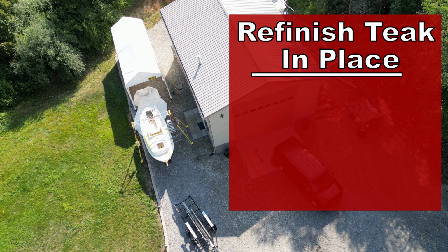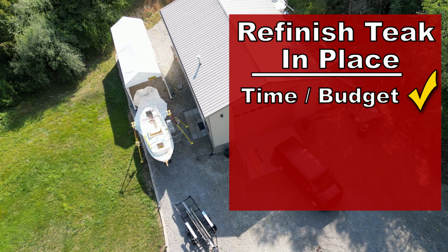There are times that it makes sense to go ahead and refinish the teak in place. For example, if you're doing a very simple, budget, quick restoration, you don't really want to pull off all the pieces of teak and have to worry about refinishing them and then reinstalling them back onto the boat. This can create a whole bunch of problems that you didn't really have in mind when you started your budget. In my case, and for illustration purposes, I think we're going to leave the teak in place on the Skipper 20 sailboat. Everything on the exterior of the boat, I don't want to pull that up. I'm going to leave it where it is. We're going to sand and tape everything off, and then we're just going to refinish it in place.